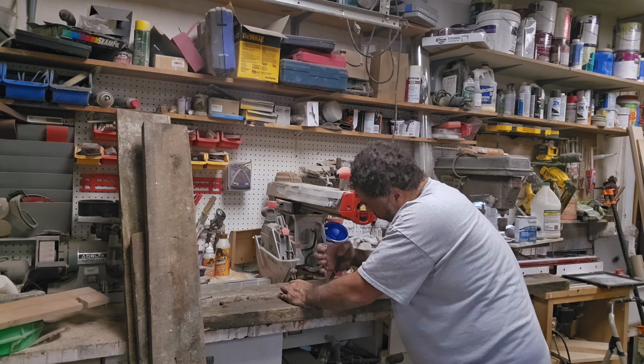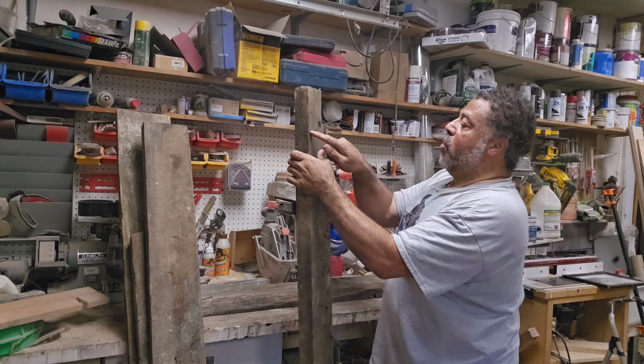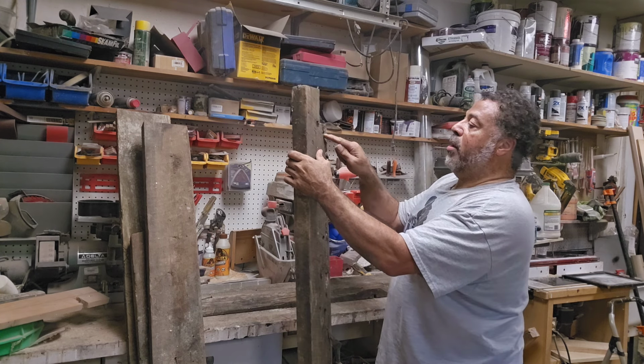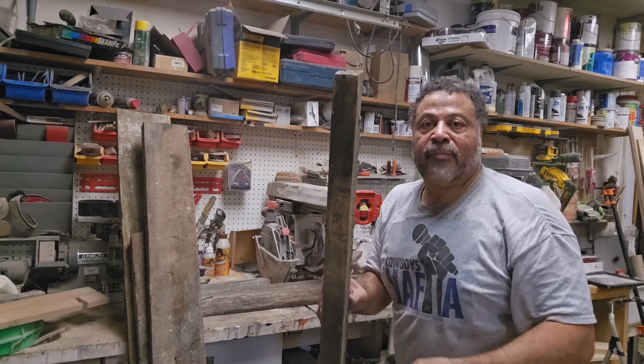Now this gets to be a little bit hard for me right now because, there we go, step one. I've got bursitis here, so my elbow is really sore. But you can see, now, this was notched because it was a floor joist to sit on the mortise that was in there. But what we're gonna do is just go ahead and cut this off right here, because that's already notched and all that little bit we can afford to waste in here. But then we'll go through and look at that.